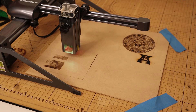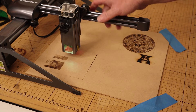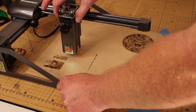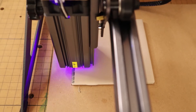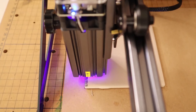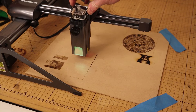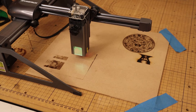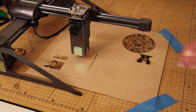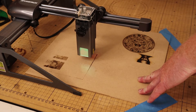This is made really, really well. You may not be able to tell from pictures, especially if you're looking at them online. But the build quality is extremely good — this extruded aluminum is really strong. Even though the end might flex a little bit if you push down on it, as the laser head is moving back and forth, I have not been able to tell any kind of difference in quality going out to the end. So I don't think it's going to be much of an issue. You just have to make sure that you're using a nice, clean, flat surface and that all of your work is as flat as possible, which is good practice anyway.